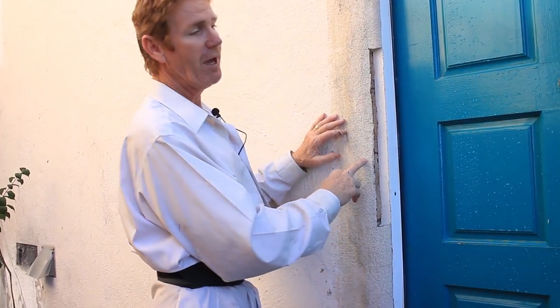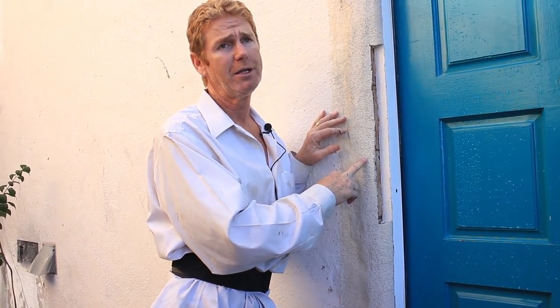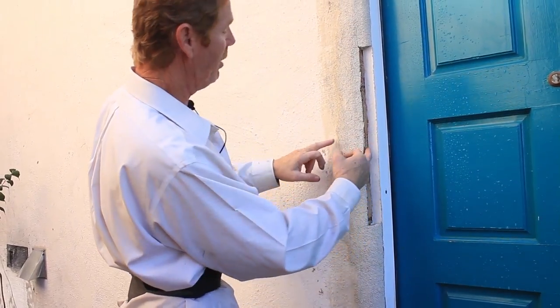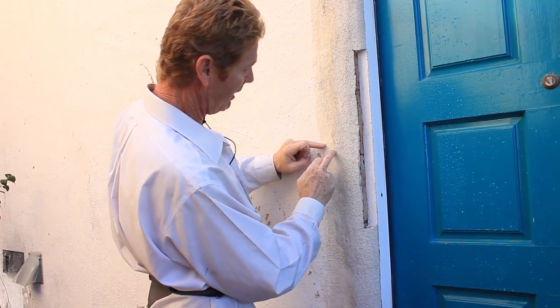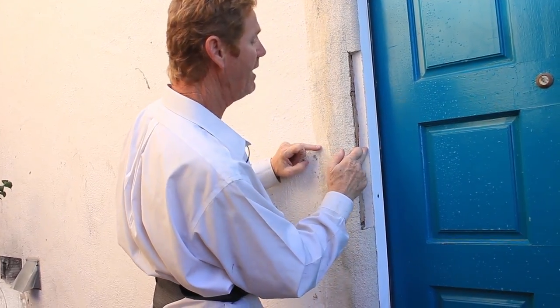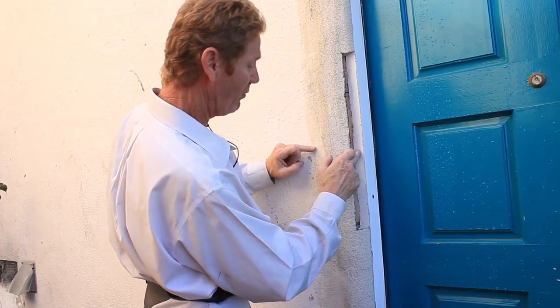Proper way to do this, guys — and by the way, I had to break the news to the homeowners. I said, I hate to tell you this, but whoever did your stucco prior didn't do it right. So the proper way to do it is: break that stucco about right here, put a membrane over this — a peel and stick. There are 10 different types. Put a peel and stick here, come over this wood and go this way as far as you can, maybe a quarter inch proud of the corner, and then stucco that.